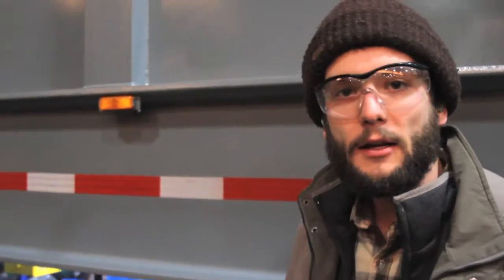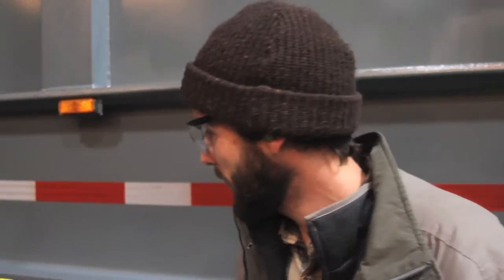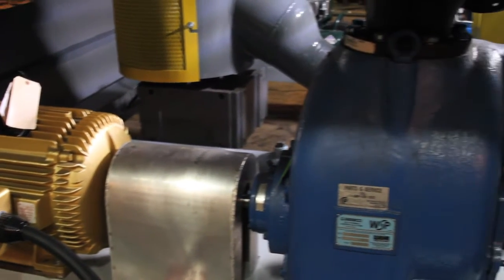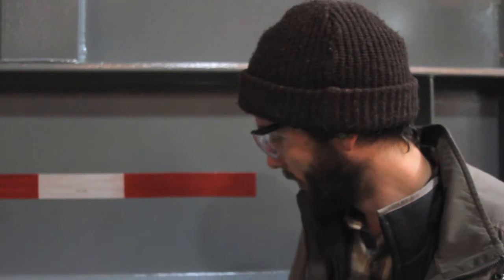This unit is checking the inflow and outflow turbidity. This is a 60 horsepower, 1500 GPM trash pump with a 26-foot dry suction head on it. It's going to be able to pull from a pond up to this unit.